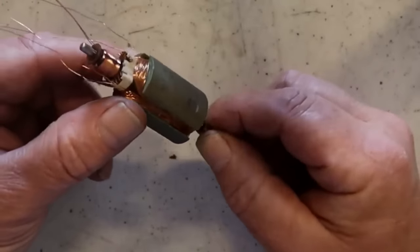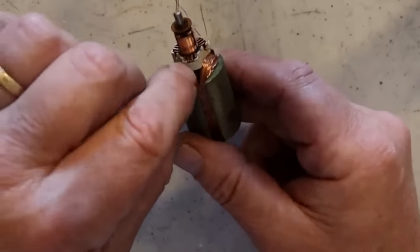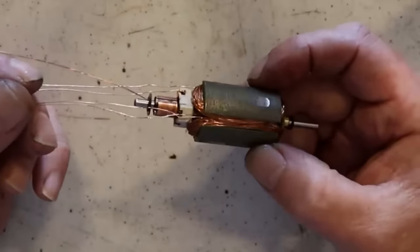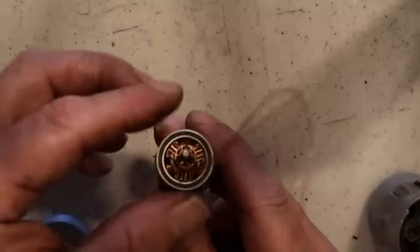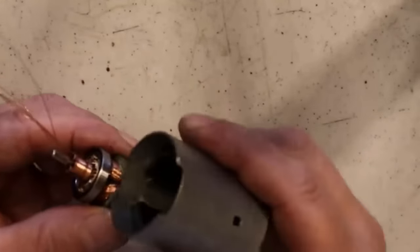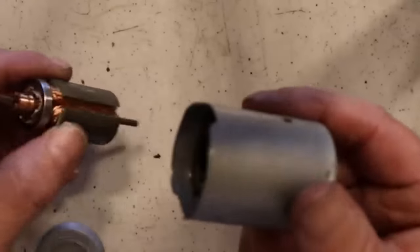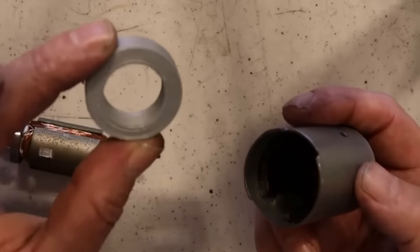Now I've got 150 turns of thinner wire on. I have a choice here: if I'd taken the coil just straight over and soldered on, it would have made it into a brushed DC generator. But I want to do something different. Over the commutator I've fitted a large bearing — 21mm by 15mm — and that means that instead of turning this inner part as we used to, if we fit the body over it we'll be able to turn the body while this stays still. So this becomes the stator, and this becomes the rotor.